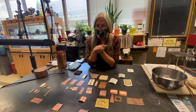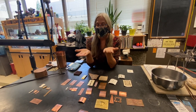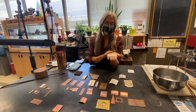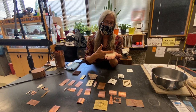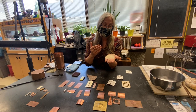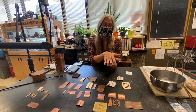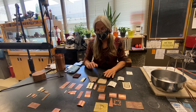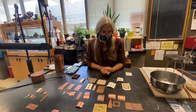When you're here in this studio, I really encourage people to make sure that you sandwich it. Another reason is that if you just put the material on the piece and roll it through, the rolling mill is only coming in contact at one point. I don't think you get as good a print as if you've got another layer holding it in place, spreading the pressure across it. So it's good to save the rolling mill by doubling up, and you'll also get a better print.